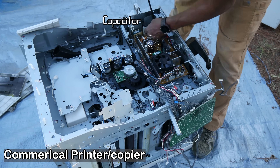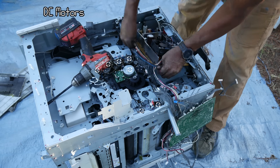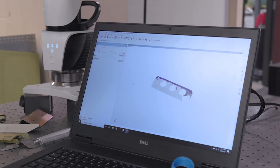Any sort of adhesive needs to be cleaned off. Welds need to be ground down so that you can scan the bare metal. And again, these scans will be brought into CATIA, and these parts will be compared with what they can find inside the drawing. The drawings will help you get it exactly to the original, but the scan will help make sure your mental picture is correct.